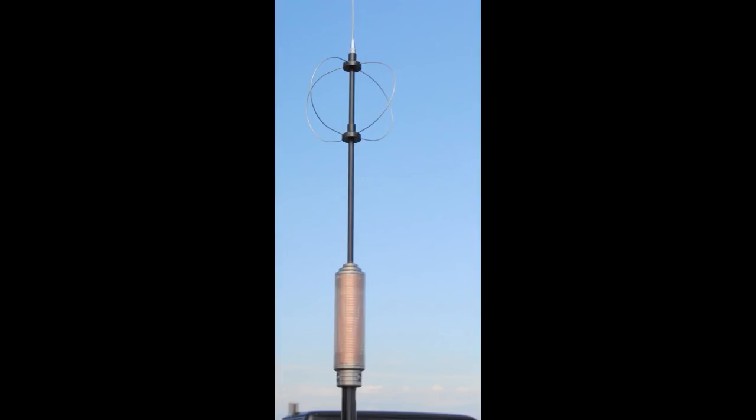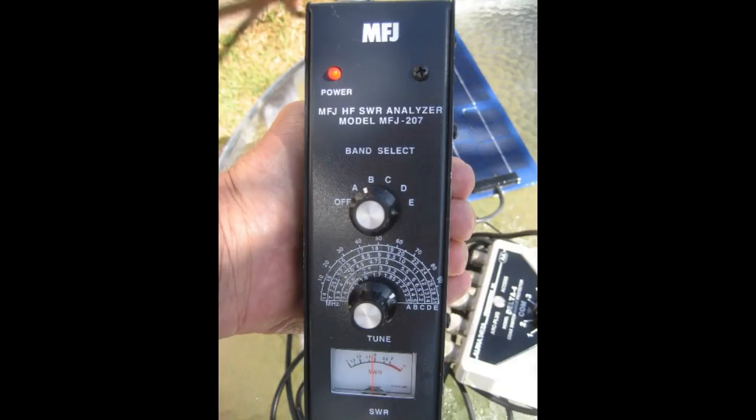When we get to the larger antennas, such as Charlie's high Q antennas, and we've got a couple of them here, including a military one, when you begin to add the capacity hat and then the big tall whip on top of that, you're going to increase the efficiency, but it's going to throw off that 50 ohm that you hope you would have matched at the base. So anytime you're working with any of these much larger antennas where you can play games with them by adding the capacity hat, and by the way, that capacity hat down on 40 meters lets you reduce the number of turns that you're making on the contactor by about 2 or 3 turns. That means more efficiency up at the top of the antenna.